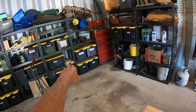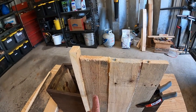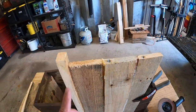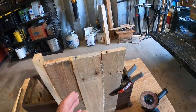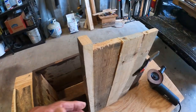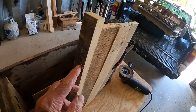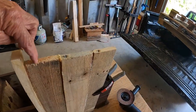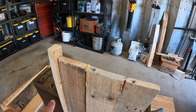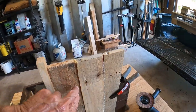I've got a bunch more top bars already made. I put this board in my vise — the bottom board first. I find that pallet wood is fairly close on the joints, fairly flat. You can fine-tune if you want by running it through the table saw and truing one edge up. I put three deck screws right down through into the timber, glued it, and then screwed it through. Then I flip it over, put the top bar in the vise, and stand it up straight.